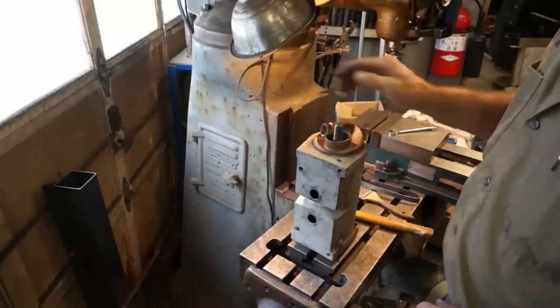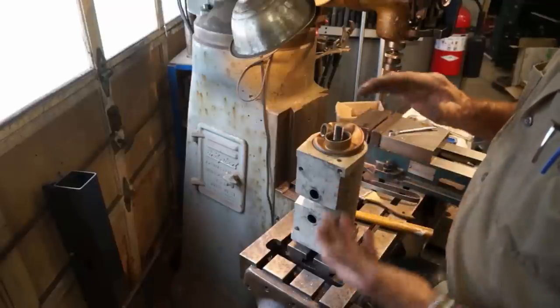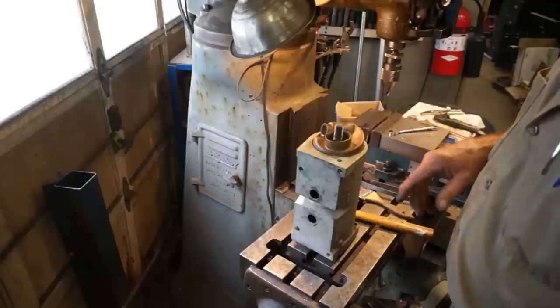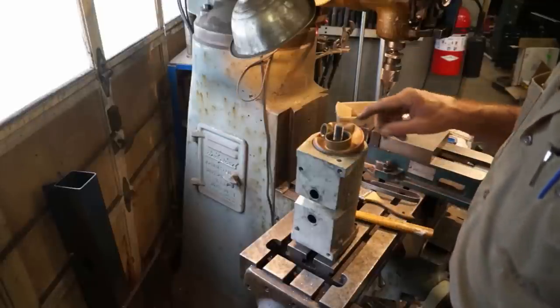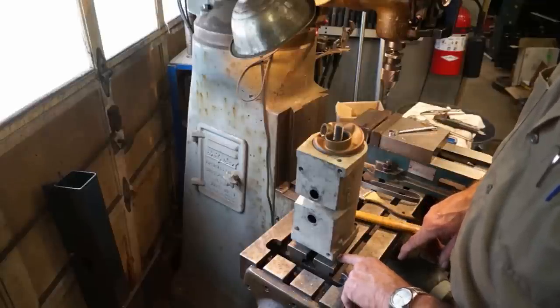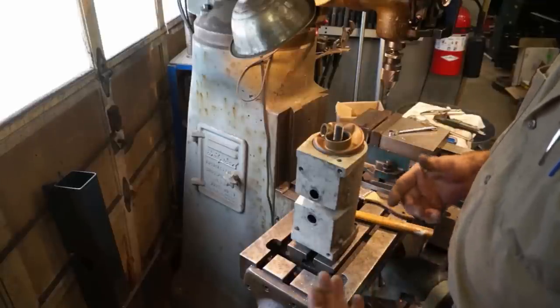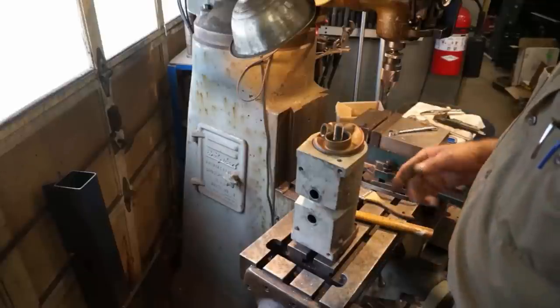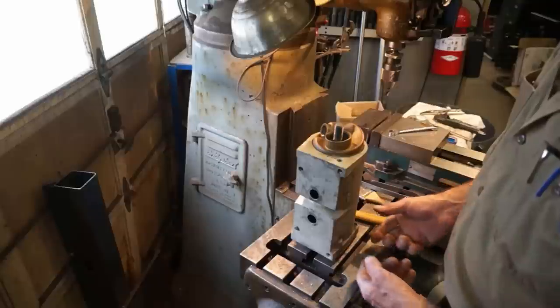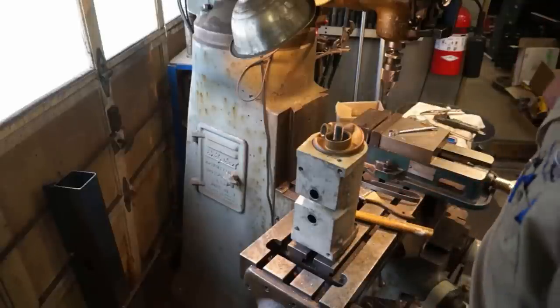We're going to see if we can get some flex or motion in between the O-rings that I think are just a little sticky, and that's what's keeping this thing in here. So let's head on into the press, and we're going to see if we can get a little bit of motion out of this. And if we move it the height of those bolts there, then we know that we're going to be able to go ahead and get this thing out safely. Then we can get some parallels probably underneath behind that flange on that end of the tube sheet.